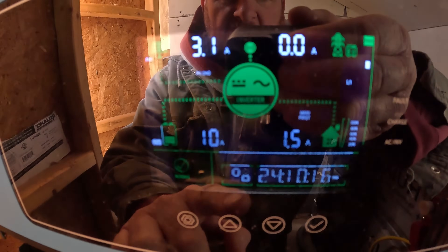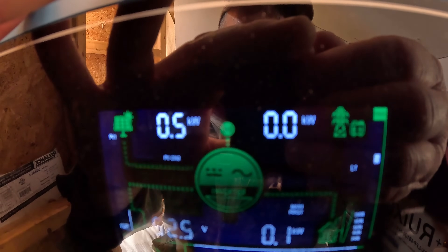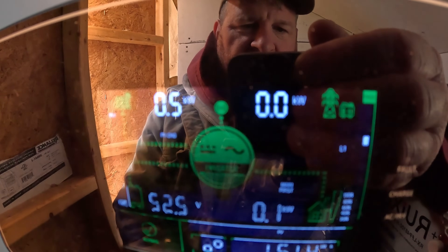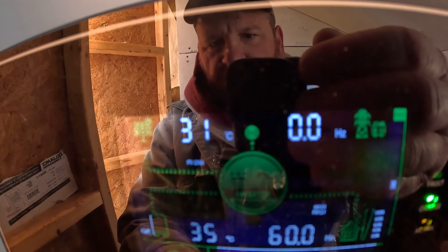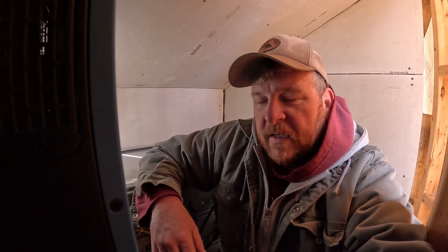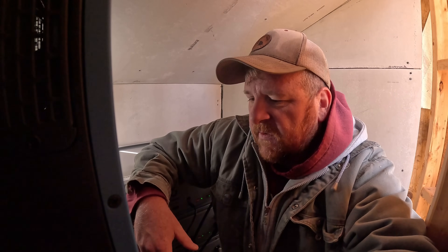About 2 or 3 amps. If we push the arrow again, that changes it to watts, kilowatts. One array is 0.5 kilowatts. That one tracking system is in the shade — the bottom panel — and they're all in series, so that cuts out most of the power when one of the panels is in the shade. Right now we're only getting 700 watts total: 0.2 on one and 0.5 on the other. A little bit of shade makes a big difference. The temperature is showing 31 degrees Celsius, which seems really warm. There are lots of different settings in here. It seemed intimidating, but you can figure it out. Might take you a day, a call or two to the company, or a few YouTube videos.